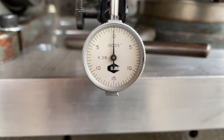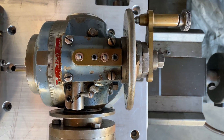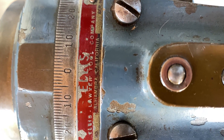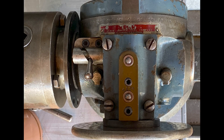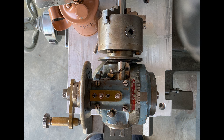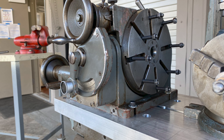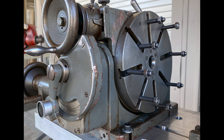Since we thought we'd do some gear school work — gears for makers — and show everybody how to make a gear with the dividing head, we also wanted to just go through this equipment now. Here's the Ellis dividing head itself. We featured it previously, and it has plates for making different segments in a circle and also has direct indexing as a 12-hole plate. It's very flexible. It's got a three-jaw chuck on it.